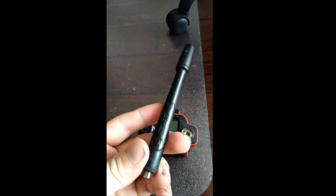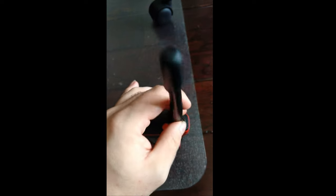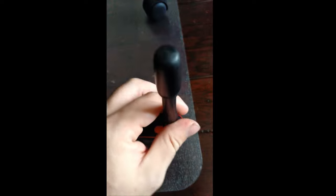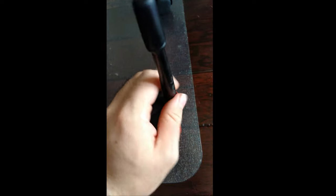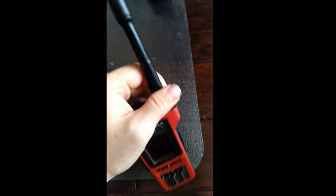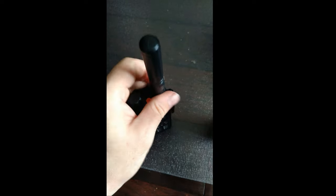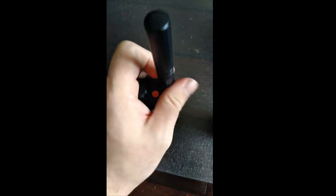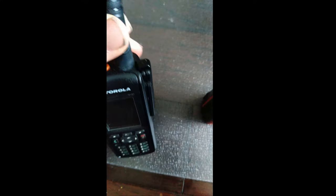I actually did just buy a few of these antennas because I like the look of them. I'm going to put them on my APX 4000s since I've just got basic UHF stubbies with no GPS on them. These are the EX antennas, so they can handle extreme temperatures. The whip antenna for the 6000s looks a lot like the 8000s except it has the aforementioned little bit of plastic on the bottom.